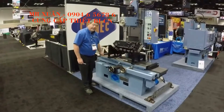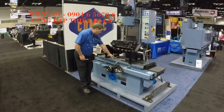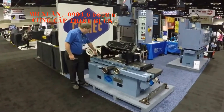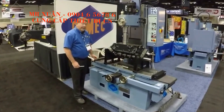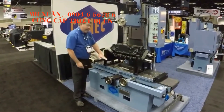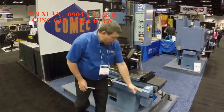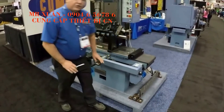This is the table on the ACF200. It is over 2 inches thick and also has T-slots all the way through. On the ends, it makes it very easy to put the T bolts in. It comes standard with a set of 8-inch parallels and also the fingertip lineup fixture for doing heads and blocks — that is all standard.